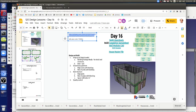So we can only move it like, say, 3/4 inches down. That's probably what we should do, so we can still screw it in at the top and be uniform everywhere. If you leave 3/4 inch, you're good. Then we have a little bit of a lip so that when we put the modules on the house, we use that as a lip to align against the outer rim of the second story platform. Does that make sense? So we have a locating lip on the bottom. It's also a drip edge so that water doesn't get under the panel. So we can do 3/4.